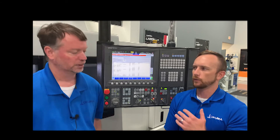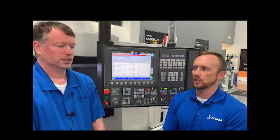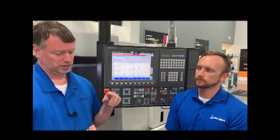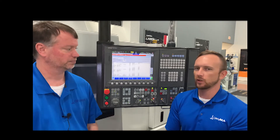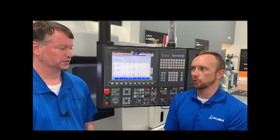So what are a couple of those tags? What information are we actually pulling from the machine? It's productivity data and machine status — it'll tell you the current alarm, whether the machine is running, program name, part count, things like that. Also tooling information: what tool is running, what the offset is, and what the wear of that tool would be.